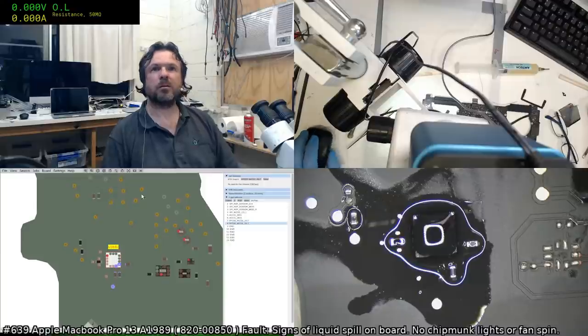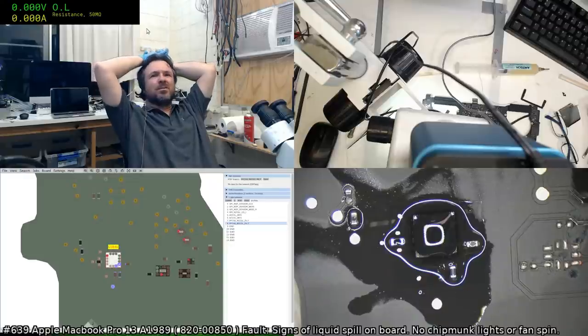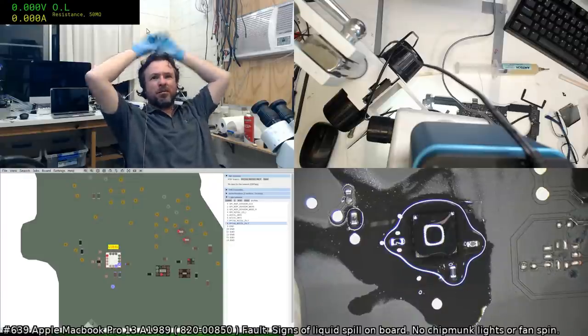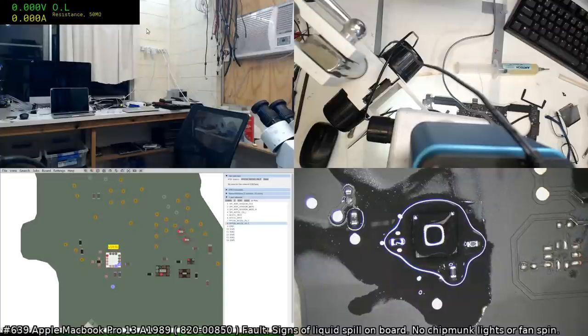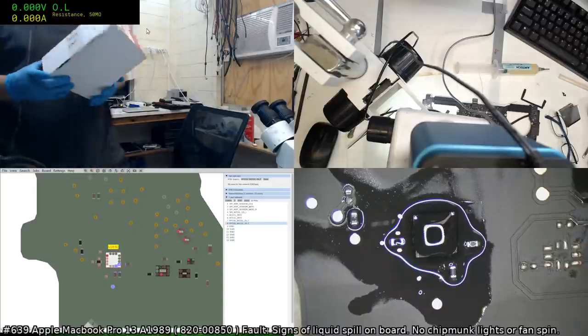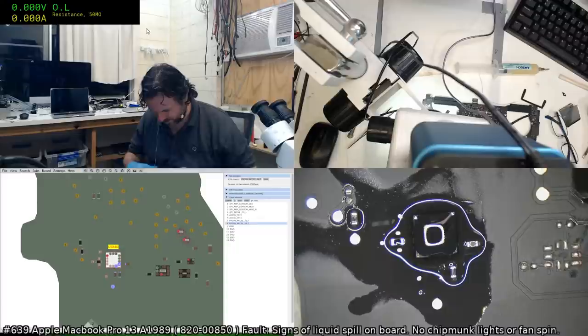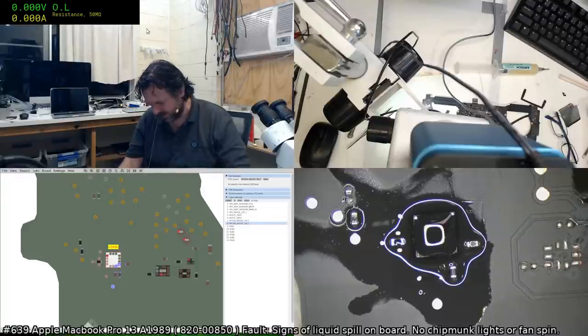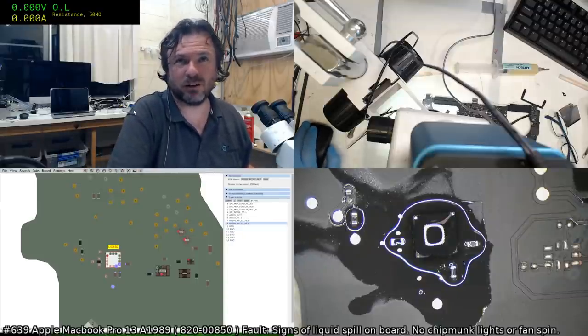Let's see. That there is a what? 220 nanofarad, 10 volt 201. Who comes up with these values? Now, because it's a filter one, I probably will have to actually honor its size and things like that. I mean, I could be wrong. It could just be filtering the power line. I'm not exactly sure. It does look like it's just a power line, filter line.